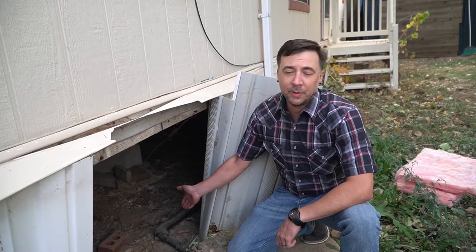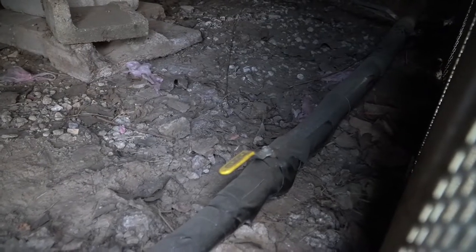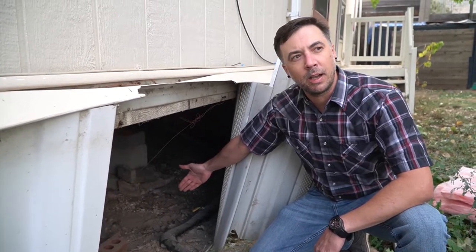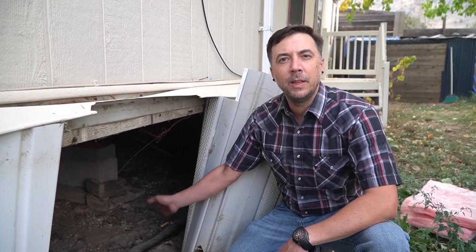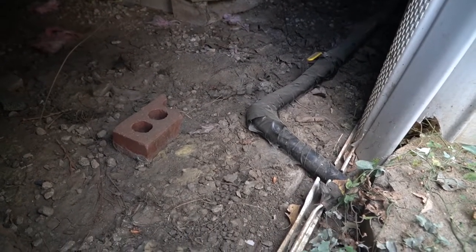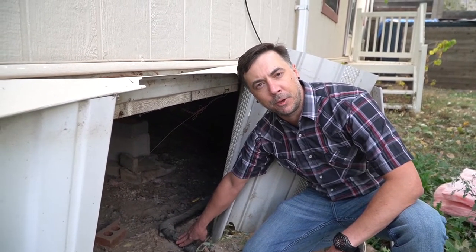The typical location of the main water shutoff for a mobile home is right behind the skirting under the home. You'll have to find out where it is along the length of the home, but it usually looks like a colored handle in line with the pipe — in line means it's on, and if you turn it 90 degrees, it's off. If you have any major leaks in the home, start here by turning the water off, then determine where the leaks are. It's also very important to keep this pipe insulated — you can see it has black foam insulation completely wrapped around the pipe with tape, which helps keep it from freezing in the wintertime.